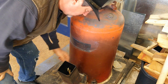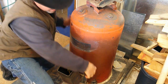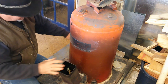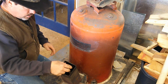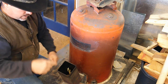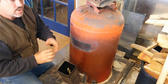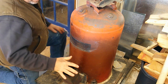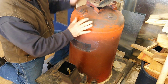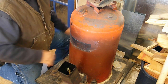Now this is bolted down onto a piece of insulating fire rope, so if I ever wanted to take this off and clean out the inside — because ash will collect down in here on the bottom — it's got about five or six inches above the vent pipe in the back. You feed your wood in here; it's basically self-feeding after it gets started. The sticks will drop gradually down inside, burn off, and you just keep throwing little bits of sticks in there. This stove happens to like one-inch square or one-inch round pieces. You don't want to choke it off, so you can't put too much in at a time. You could fill this whole thing and it will settle down and burn, and it'll bring this shop up to nice and toasty in no time.